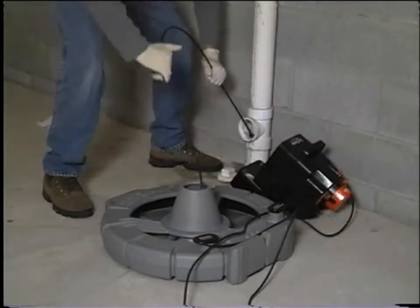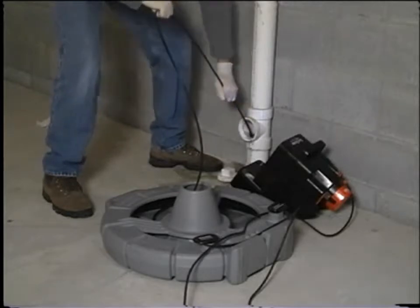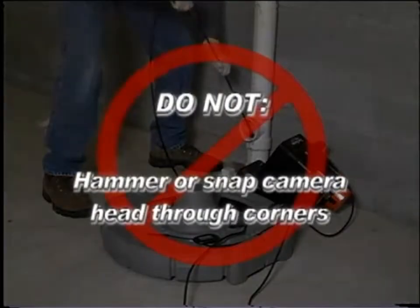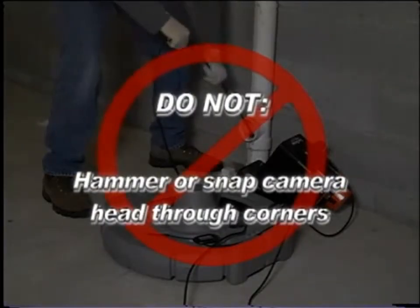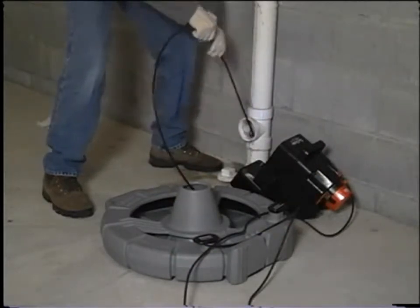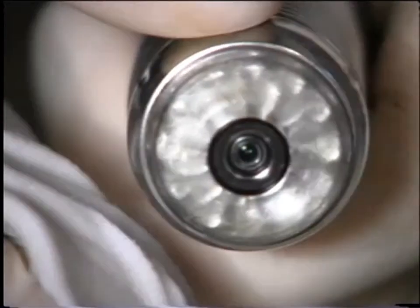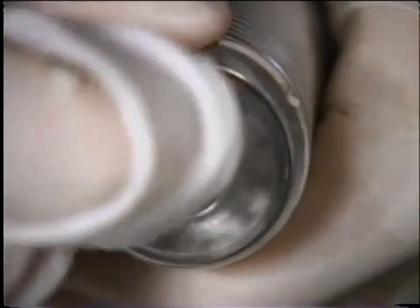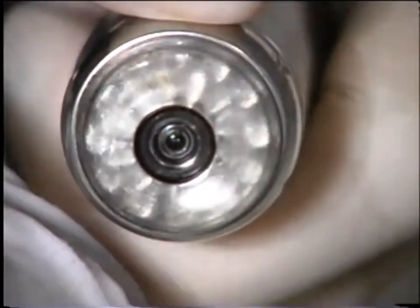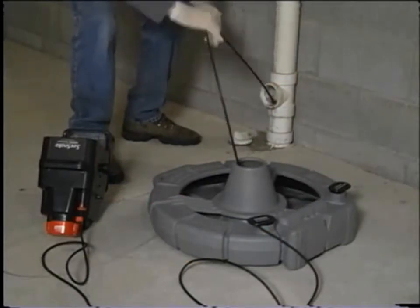When inspecting the pipe, it is usually necessary to give a little extra push in the bends. Back the camera head approximately six inches from the bend and give it a quick push, popping the camera through a turn using the least amount of force required. Do not hammer or snap the camera head through corners. The best way to inspect a section of pipe is to push the camera through quickly, then draw it back slowly and evenly — it's easier to control the camera when pulling. Make sure the sapphire window is clean prior to entry; a slight film of liquid detergent on the lens port can help minimize grease sticking.